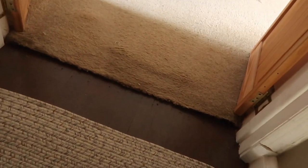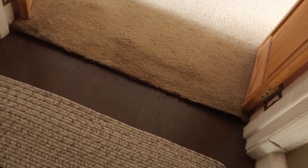I have a few handyman jobs today: the railing, painting the little brackets, and I have to do a transition from rug to the new stairs. I had to cut the rug so I want to put in a metal strip in the doorway. I bought a bronze one. It has to be drilled into the hardwood — it already has holes in it. Right here at the top step is where I cut it, so we'll put that across. I've got to cut it to 32 inches, then go back out and install it.